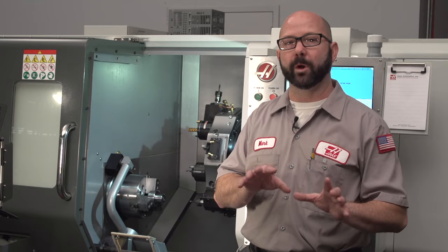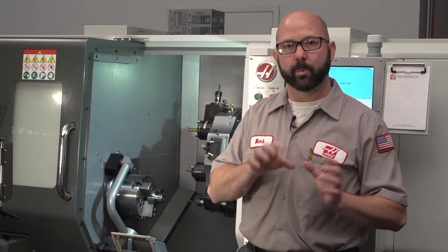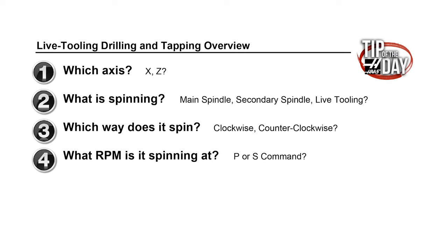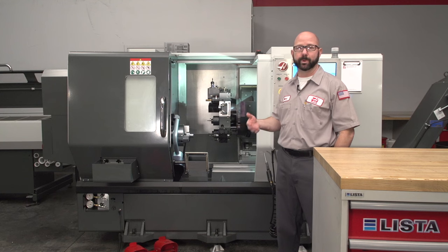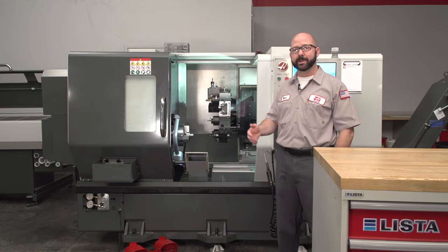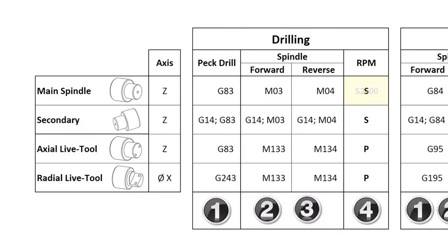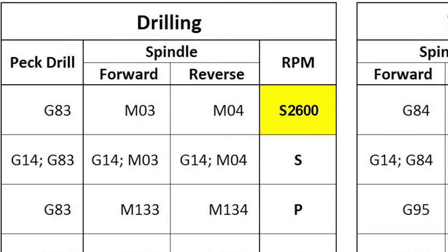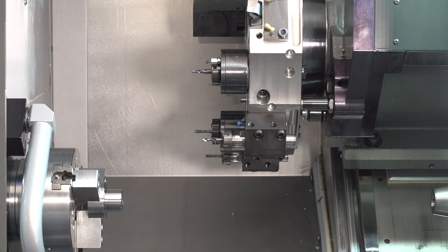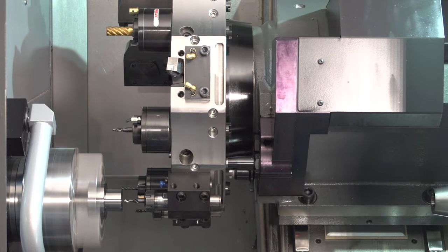This is a little corny, but it's going to come in handy when we start talking about secondary spindles. Number four: what RPM is my spindle turning at? I want to drill at 2600 RPMs, so I'm going to command an S2600 from within my program with no decimal point. That's pretty much it — we know how to drill using our main spindle.